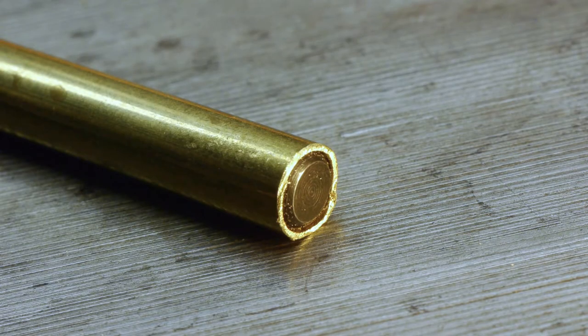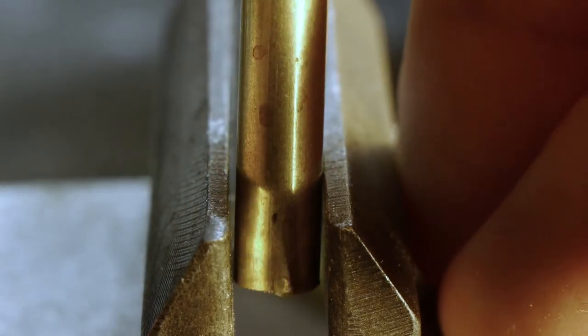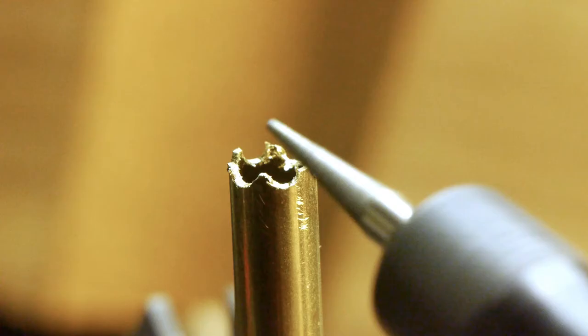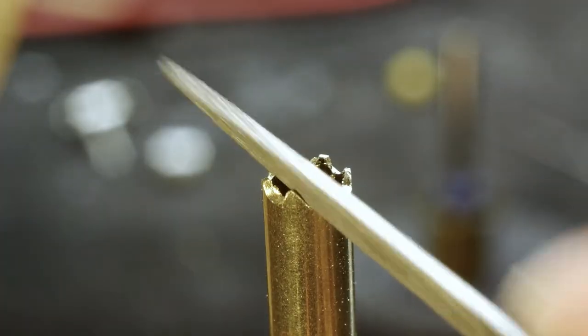The crimped end will hold the pin in place and this will make a solid contact point so the tubing can be clamped firmly in a vise and chucked into a drill press. Notch the edges with a Dremel cutoff wheel, then refine and point them with a conical diamond bit and a needle file.